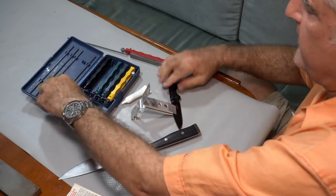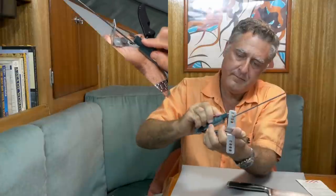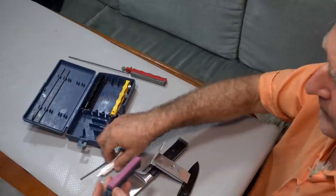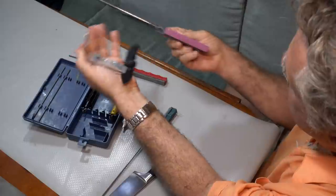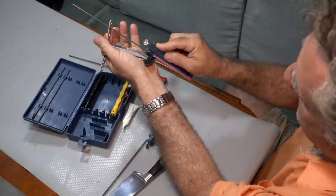Since I'm going to use this one again, I'll leave that one rigged for the other knife and rig a new one here. This is the medium. I'll go to 25. All right, it's a huge difference. After I'm done, I just wipe a paper towel and wipe the oil off, and that takes the metal filings right with the oil onto the paper towel — pretty trivial. You can start seeing now this little darkness that's forming. On the fine stones, you can actually see the metal filings come off into the stone. You can see that it's doing something.